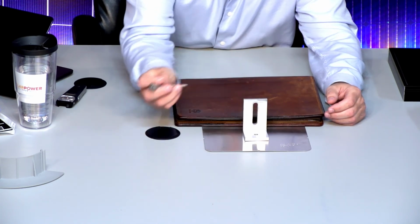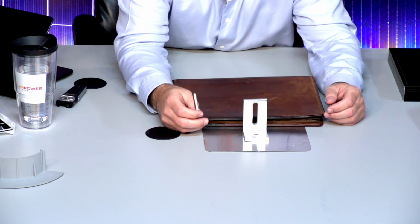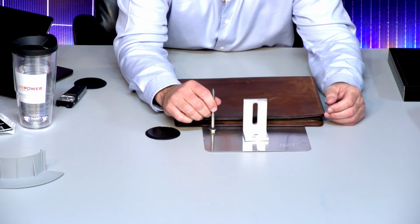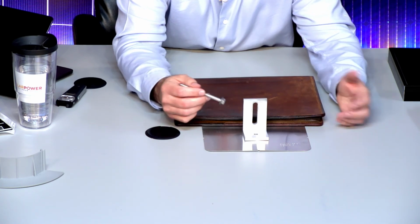So a lot of people ask me, are these things secure onto a roof? And I'm going to tell you, you put this lag, and usually, not always, but roughly about 1.75 of these will go in per module. So if you have 20 modules, let's just do 10, you're going to have about 18 of these feet in the roof. So this is very secure.